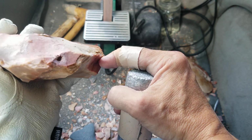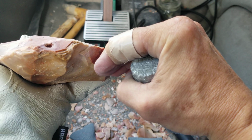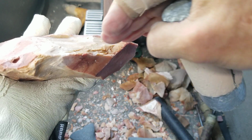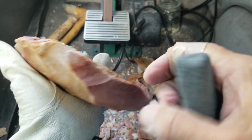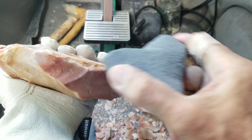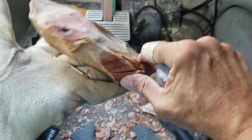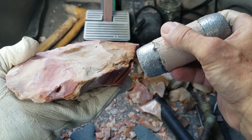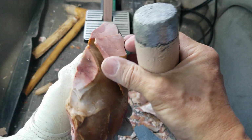If you're above center line, you usually just skim the top. But if you scoop it out, a lot of times it'll scoop into the material, and then when it comes out the other side, it takes a lot with it as it tries to come out of the depth, out of the dive. There's a danger that the scoop could just be a scoop, and then it's not that good. But sometimes when it comes out of that dive, it'll take a lot of it with it on the other side. And that one I detached on the slide just so I do not risk too much mass taken off, because if I gouged it, it does scoop it a lot, but it risks taking too much. That was okay.